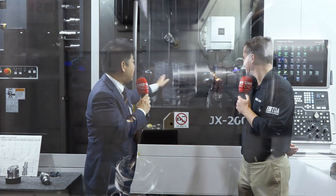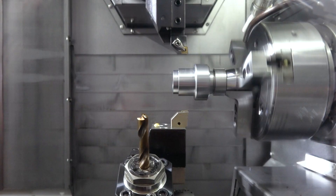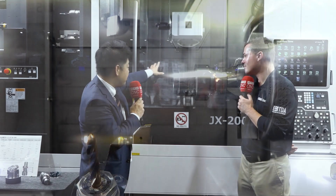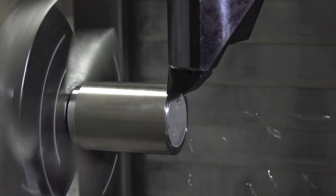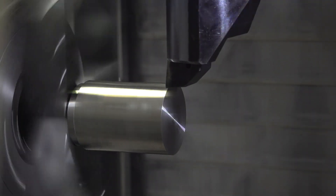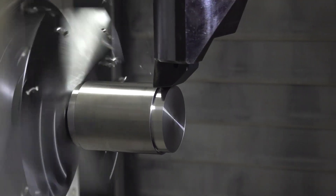You see the stroke — lower side, the lower turret can go left to right, very easy. That's also true on the upper side, you can go left or right easily. That's why you can reduce cycle time very much, because you cannot stop the machining — you can keep machining all the time, and you can get a very short cycle time.